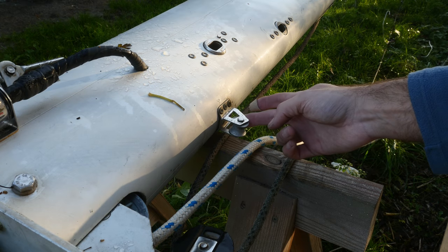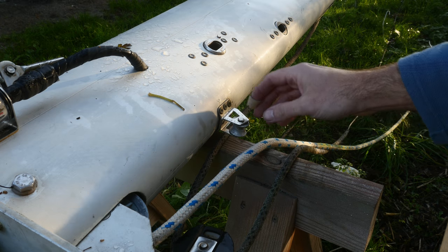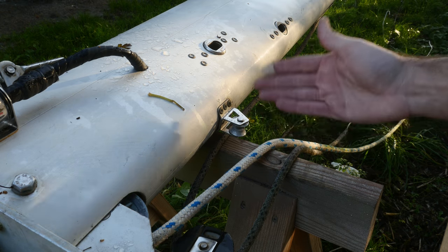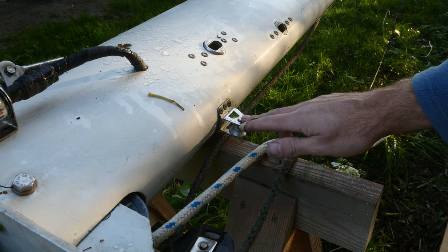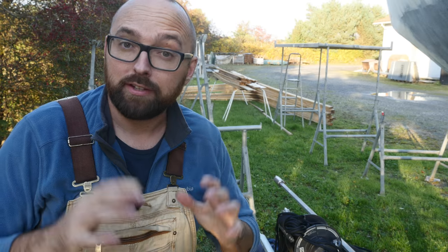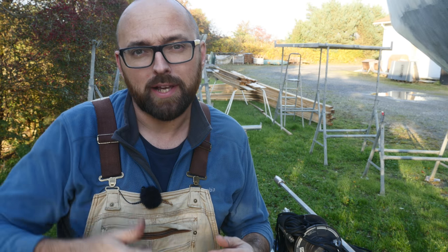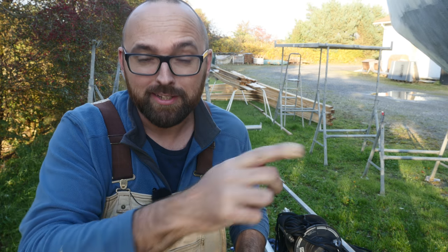Here on the mast is a halyard diverter. The job of this is to alter the angle of the halyard so that you lessen the chance of halyard wrap, which is where the halyard gets wrapped around the furler — a really sucky situation. This one is pretty well used, but in the photos from when we sailed Athena back home to Denmark, this wasn't actually used. The deflector should show up early next week and I'm definitely going to fit that. But the diverter — well, I don't really know. I think I'm going to go up the mast once it's stepped just to see how everything looks. For now let's just deal with the swivel.